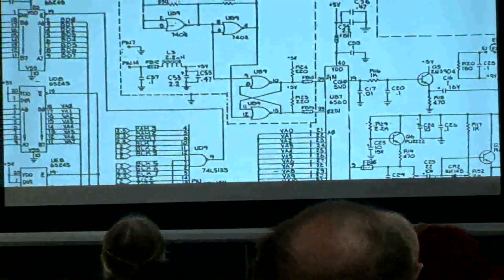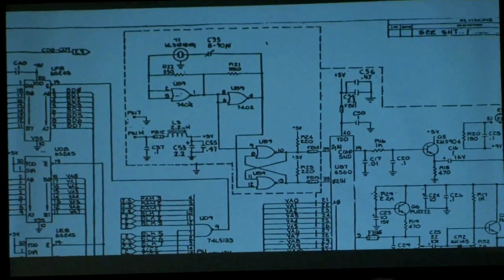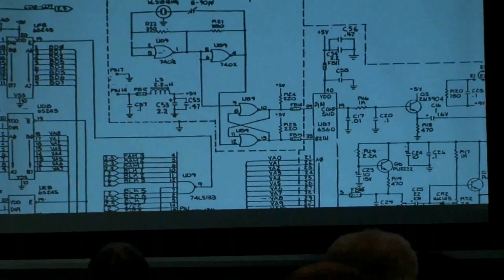So in the VIC chip, you didn't need a phase lock loop because the frequency was non-intrusive, or was it just quieter because there weren't DRAMs? It wasn't DRAM. It was quieter, and also the bit rate was half. So it really never impacted the phase, the interference of the phase with the black and white. It looks like on the VIC, they took the 14-something megahertz, which is the color burst times four, and then divided it down, and this also naturally gave you the 22 columns. Correct, and that worked fine.